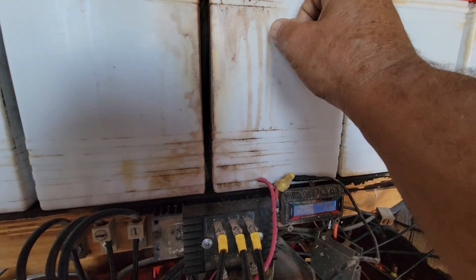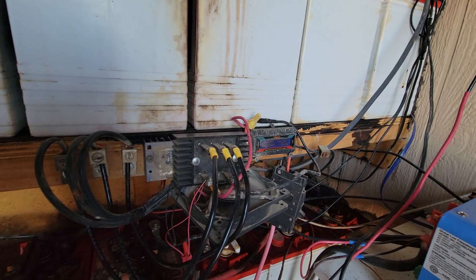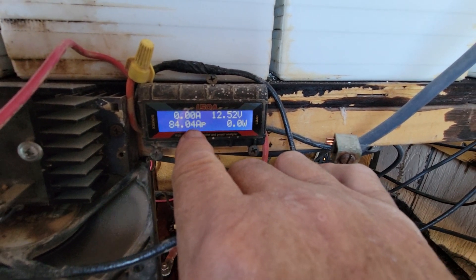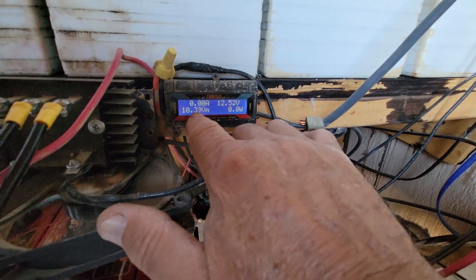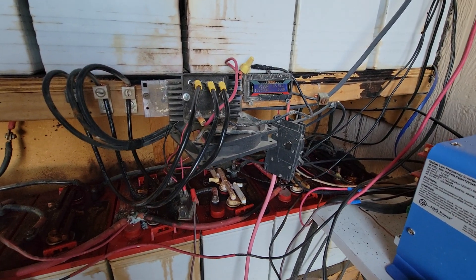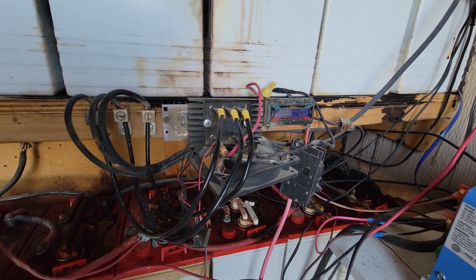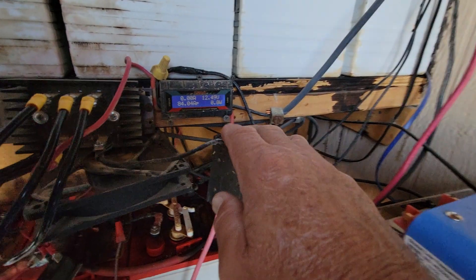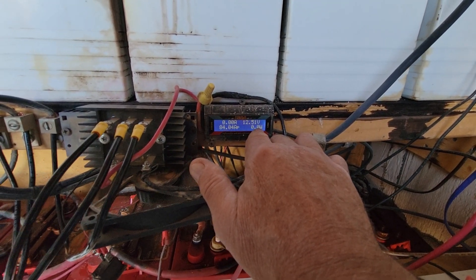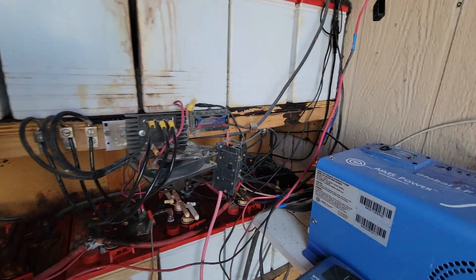It's not really anything more than a stain. Anyway, here we go — 84 amps, 1,269 watts. No wonder the 60-amp fuses blew, that's what happened. It did not hurt my PMA though — my turbine is working just fine. Right now there's no wind so it's not producing anything, but I hooked it up when the winds were blowing and checked it — it's working fine.